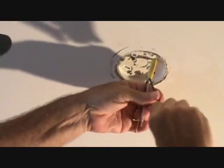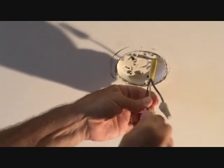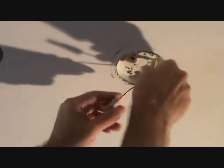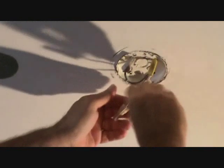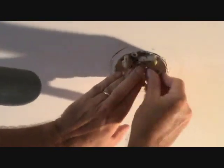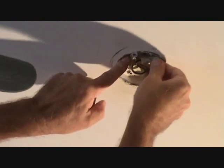Now these wires are dead, but because I have the light switch off I'm going to go ahead and put the wire nuts back on here. Sometimes they happen to fall off — if they do, you can put some tape or a smaller wire nut on there. I'm going to push this back up into the box so that when I run my paint roller across here, when I'm getting ready to paint, these wires are out of my way for sanding, taping, and skimming the wall. Just twist your wires back up in there and put them behind those ears of the light fixture box — now when I paint, it'll go right across there.